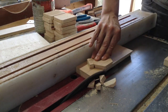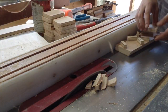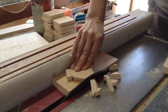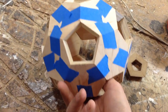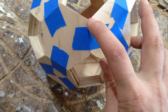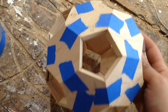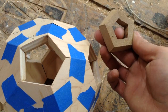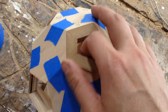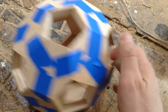I had a stack of about 24 or so — I always recommend cutting extra. These did not turn out perfect for different reasons: the tolerances on the ripping on the table saw and the plywood were a little different, but for the most part they turned out pretty identical. I taped it roughly together and everything's pretty good. A couple parts were a little bit longer than the others, so the next day I found one that was perfect, used the marks on the top, and trimmed the rest down. The big test was that the pentagons I had fit in their respective spots just about perfectly — that was a very good sign.